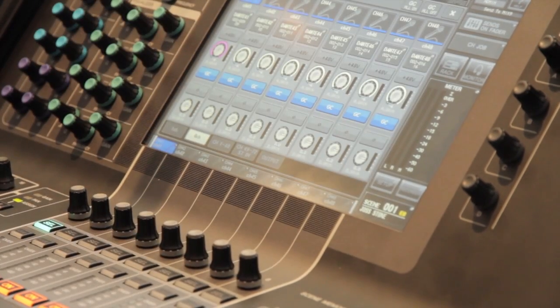The CL series features gain compensation. This is a new feature for a Yamaha mixing desk. Up to 4 CL surfaces can all refer back to one I/O unit, one preamp in one I/O unit, and all share gain. So effectively that means every 4 consoles can be making changes on their gain pots without affecting each other. This will also work for our legacy desks, so LS9s, M7s.